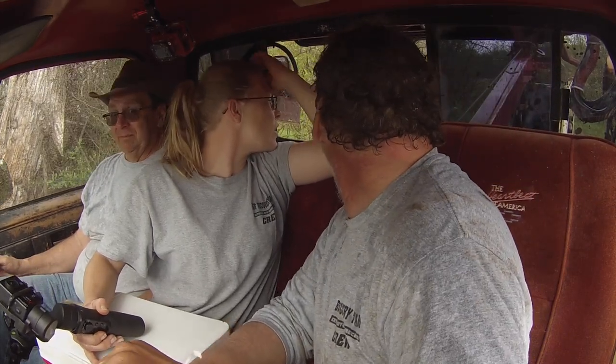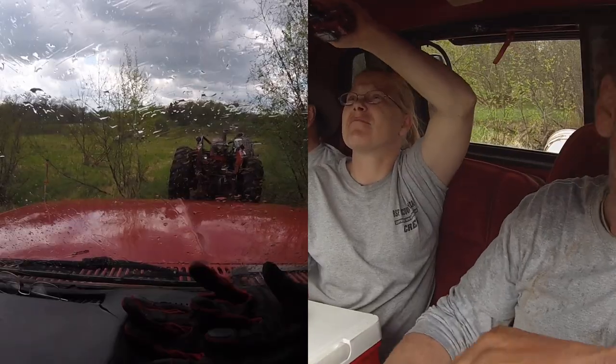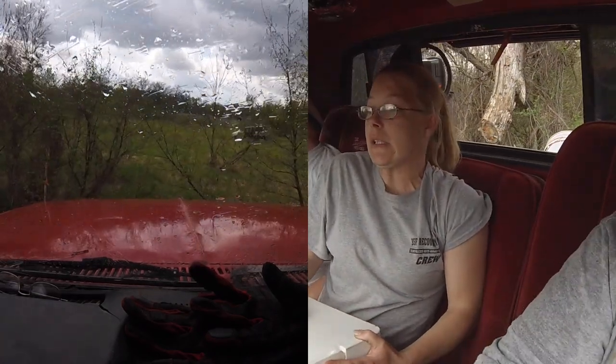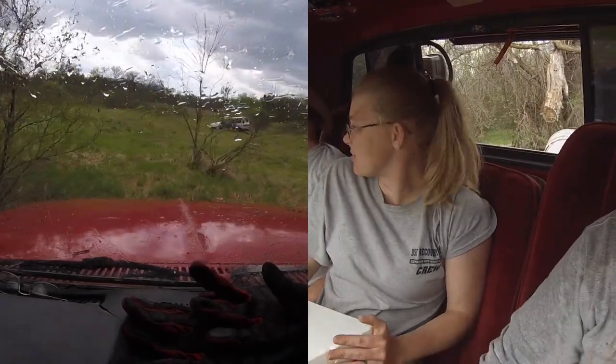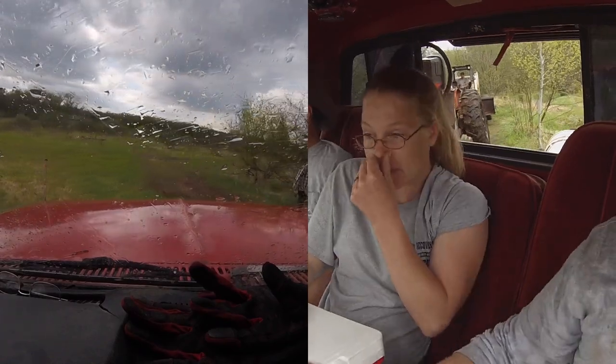Sweet. Well, the Allis Chalmers won't run anymore. Oh, hold on, Jeff's right. Yeah, I know. The Allis Chalmers won't run anymore. No fuel's coming out of the tank. Won't even fill up the float bowl or the sight glass. And so we're going to see if we can get around him here. I hope it isn't too soft. And pull him back to the house. Okay, hold on. Well, it wasn't too soft. It didn't sink into the mud.